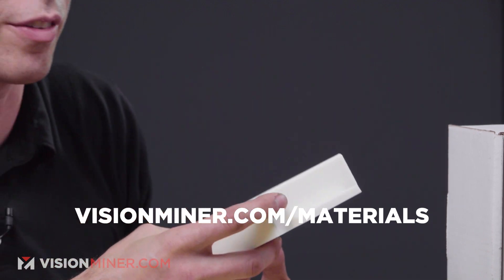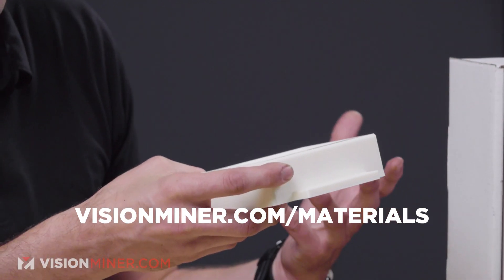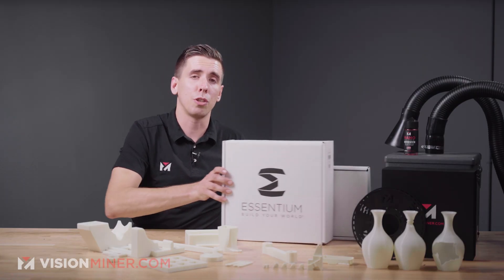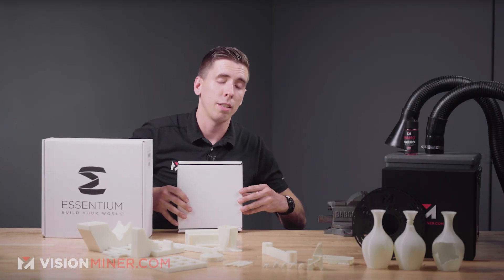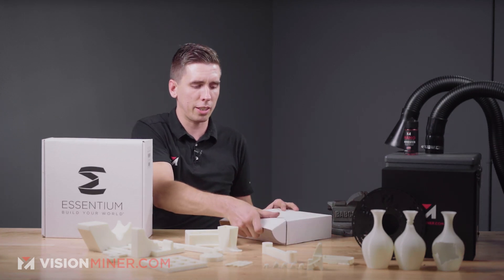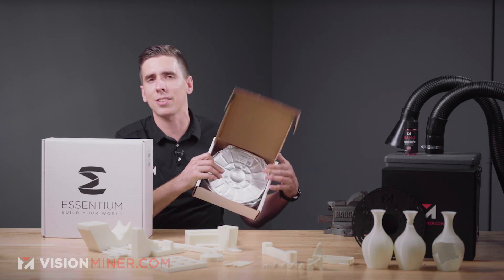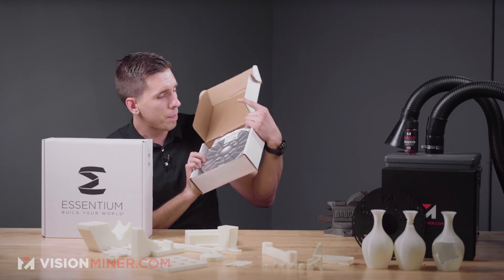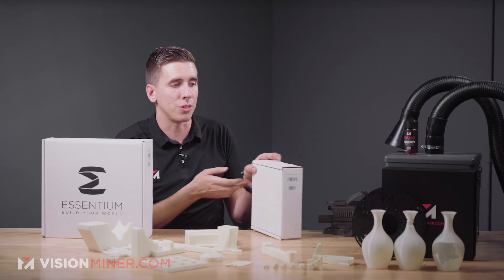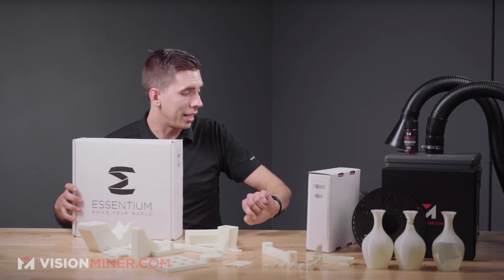You'd probably want to use the HTN CF-25 for vacuum molds with higher temperature materials, but this works great as well. If you want no electrical conductivity, note that the carbon fiber version adds a little bit. These come in a 2.5 kilo box and a 750 gram spool, in very nice metallized vacuum-packed bags. You'll want to dry it when brand new, even if vacuum sealed, just as good practice.